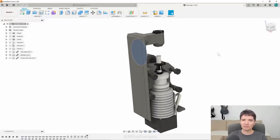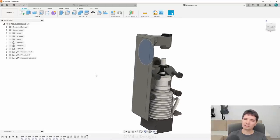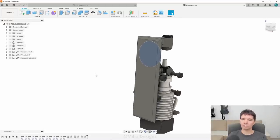I've also included an NFC tag here which can be read from the front. You can do that with your phone if you want, but it's mainly there so that the tool changer can read it. You can store useful information such as what kind of hotend is inside, what kind of nozzle, what material, what diameter. This can also be used by the tool changer to check that you're actually printing with the material you expect — for example, you have settings for PLA but there's actually PETG loaded in this particular hotend.